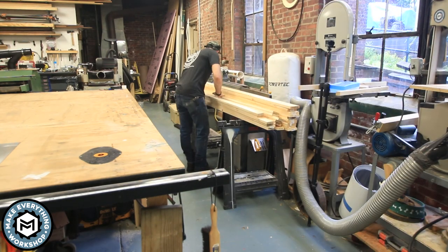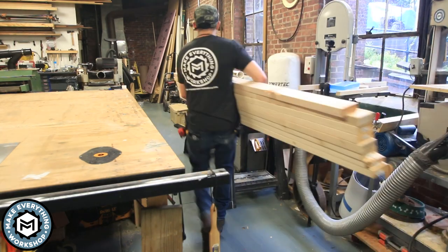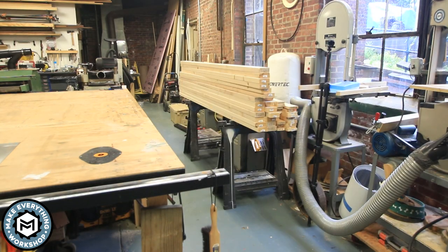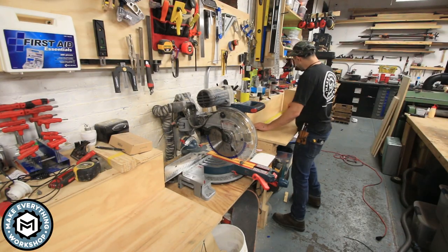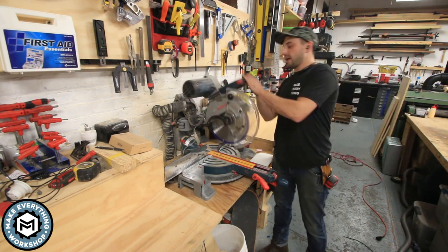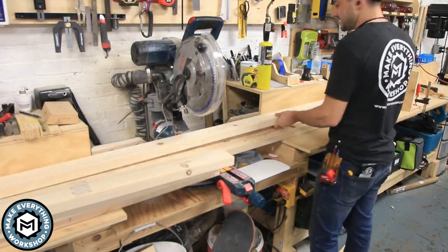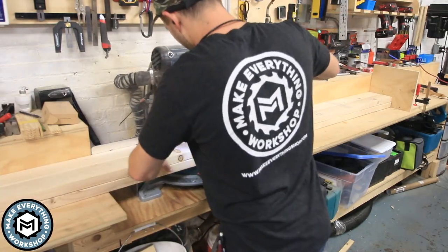Getting started with this project, it's basically just a bunch of material from Home Depot — more material than I really felt like carrying, but you have to overbuy on something like this. The construction of these is very basic and simple to build. It's a 2x4 frame with some strutting, half-inch plywood on the outside wrapped in clear pine with pallet wood.